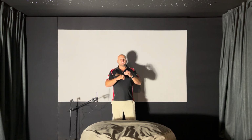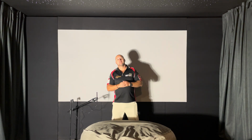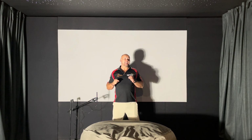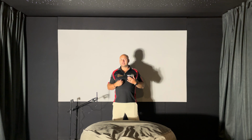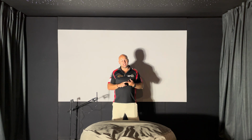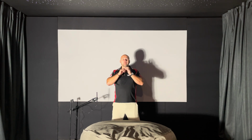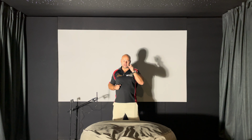Basically, last night when I sat here and I told you guys that when you do the subs, you correct them before and then you pull them in. Yes, you can. But I ran into issues last night because I did that. You get the files from Monitor Audio. I had a few different files. You need to know exactly what your sub is doing and what your room is doing with that sub. If you have that down to an absolute perfection, take that file and load it up.